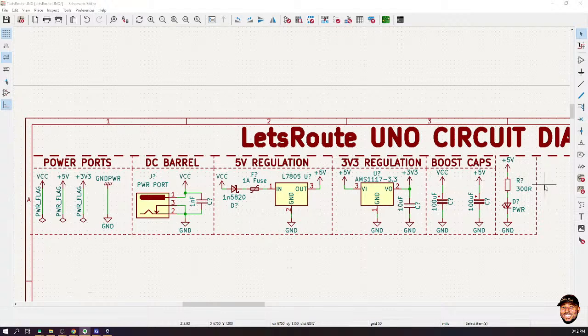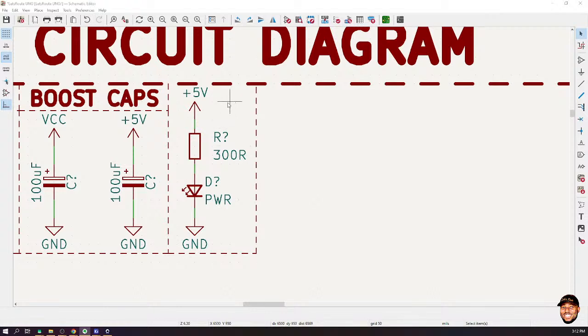Lesson three. Okay, good. So usually in circuit terms, you hear people calling this a protective resistor, okay? And actually, yes, that is the job it does. It is here so that it protects this LED from overvoltage. Now, the way LEDs actually work in a circuit is very interesting. This LED has to allow current to pass before there can be conduction, okay? So when you put an LED and a resistor in series, unlike two resistors that will start sharing the voltage right away, that doesn't happen.